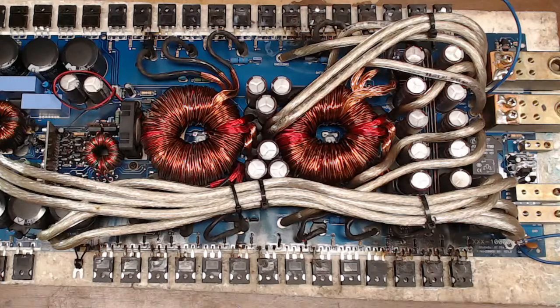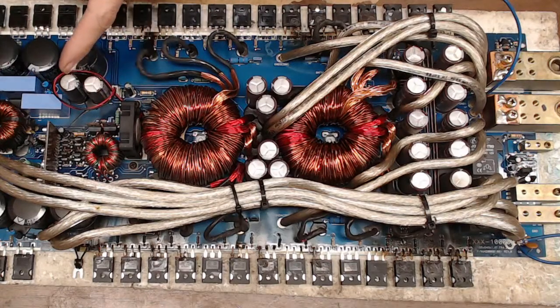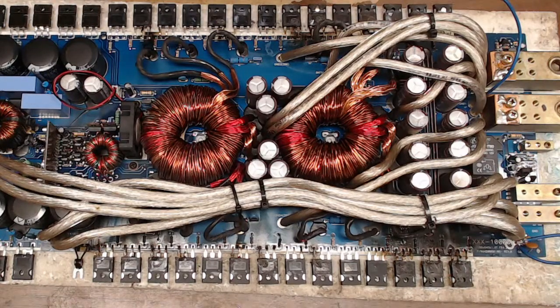This is the DLX 4060. This uses that drive card, that green drive card. I actually think I sent you a picture, Damon. That DLX 4060 drive card uses the 2113 gate drive IC on that. I am not a huge fan of these cards. This design in particular, because it uses an auxiliary power supply on these that can throw people for kind of a loop. And at first it really threw me for a loop, that's for sure.